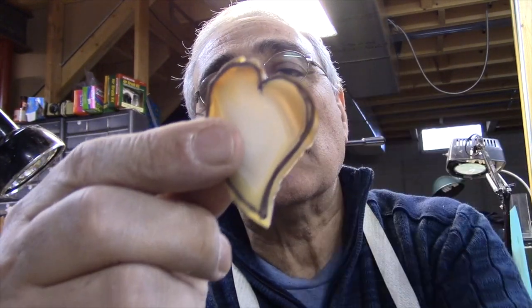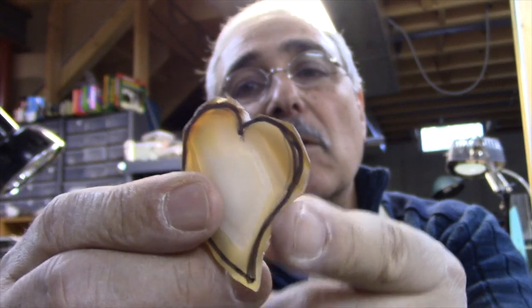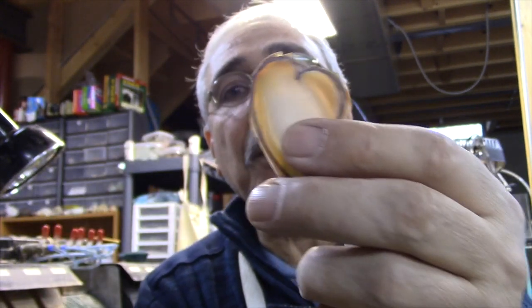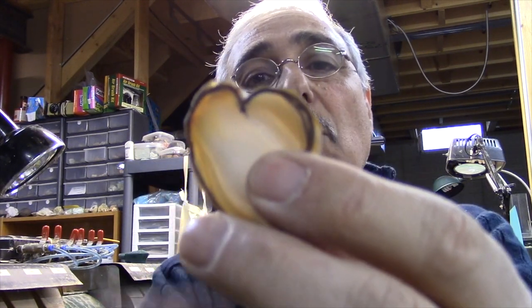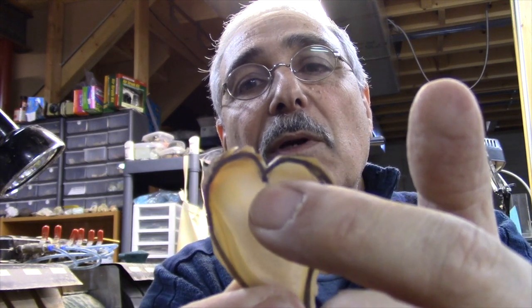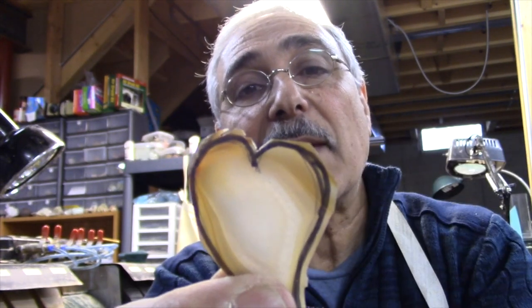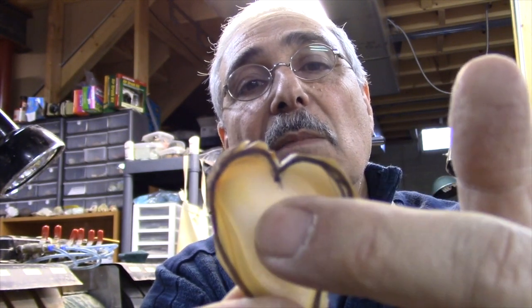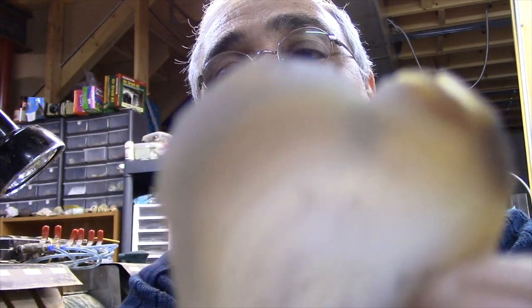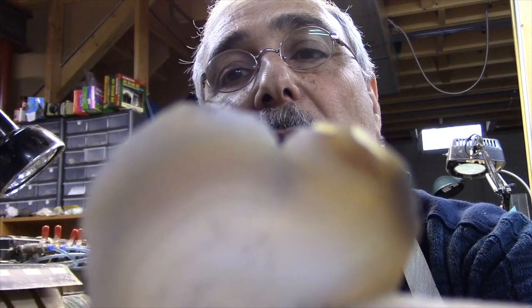The fancy design is hand-drawn with no template, and you can see the curvature at the bottom. One important thing to understand is that when you trim with the saw, you have to watch how far you go down at the bottom where your line is. The saw will cut further in from the bottom than what you're seeing on the top where your mark is. I'll turn it around to show you — you can actually see the cut is a little bit further in than the mark.